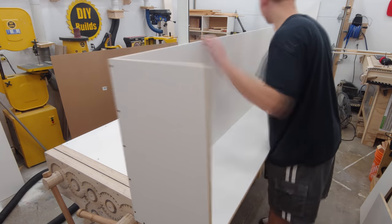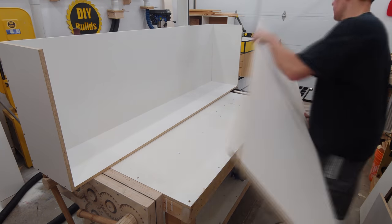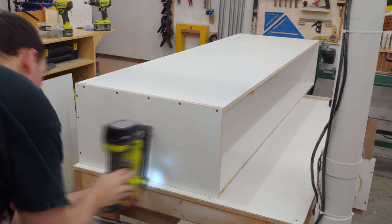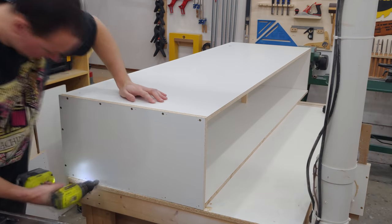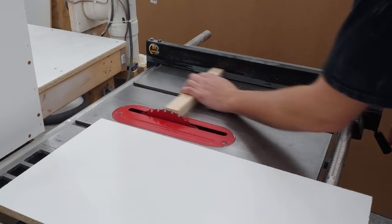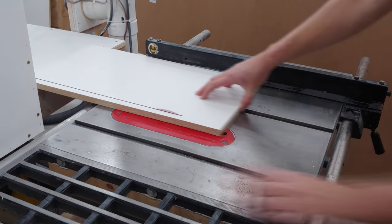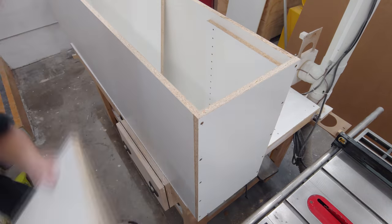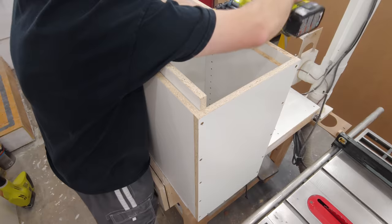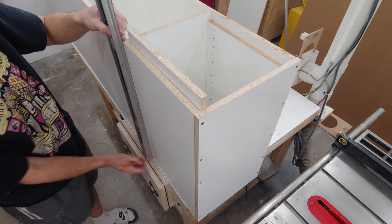To install the other side piece I flip over the unit onto it with a few spacer blocks — this makes sure the melamine isn't bowed in the middle and remains flat along the edge. The last thing to do to this cabinet is install a fixed shelf near the top. I place a few 13 inch spacer blocks and tack the shelf in place with brad nails, then mark with pencil some lines to follow as I drive in more two inch screws.